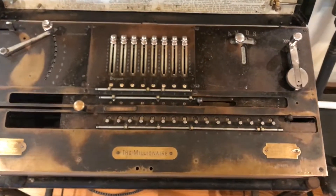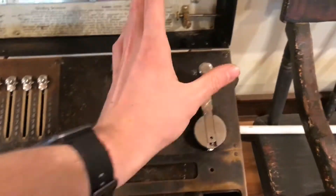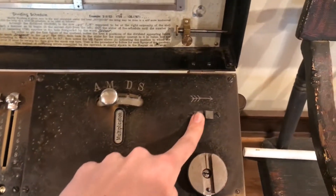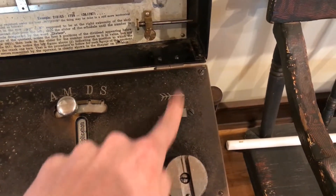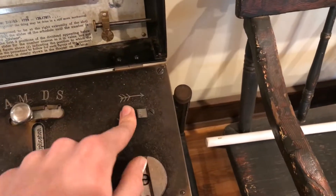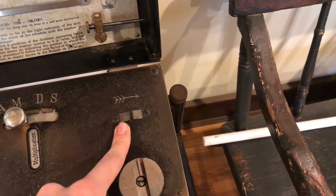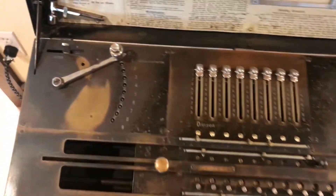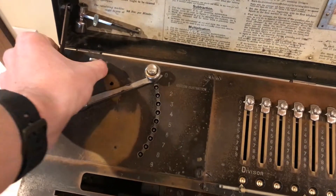To operate the electric machines, the first thing you want to do is remove this crank. There's a little spot for it in the lid — it says right there it's magnetic so it stays in. The reason you want to do that: there's a little notch right here, and the hand crank has a pin that sticks out. If you try to run it with the motor this will catch and the belt will probably come off the machine. Then all you have to do is flip the switch to start it.